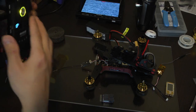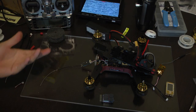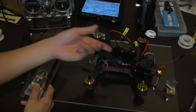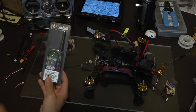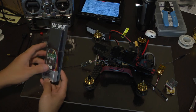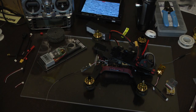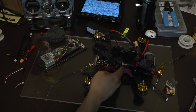That's pretty much it on setting up the TBS Crossfire system on the Vortex. It wasn't too complicated, and it was pretty easy and straightforward. The next video will show you how to set up the video transmitter to a different frequency. We're going to be using 1.3 gigahertz. I don't have 2.4 gigahertz because the right transmitter wasn't available at this time, and it would be needed for true long range FPV. You can't really get long range with the supplied 5.8 gigahertz video transmitter on here.